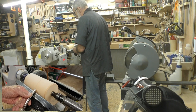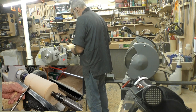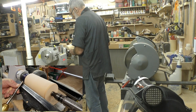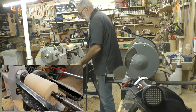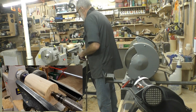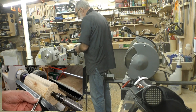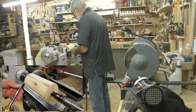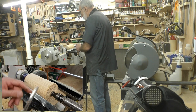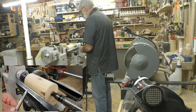This is the most difficult bit because you're coming to the end of the cut, but you've got to get your balance. Not a perfect cut, but it's a bit difficult with the cameras — that's my excuse. The point I'm making is that you maintain a steady momentum across; don't dig into the work. Let the tool do the work, let the wood come down onto the edge. This is a freshly sharpened gouge — always keep your tool sharp as well.